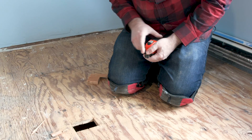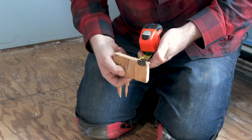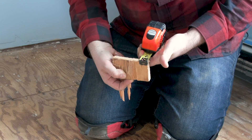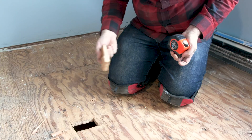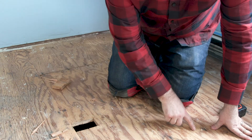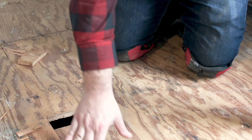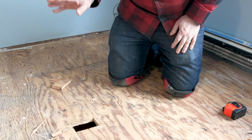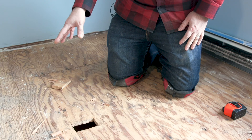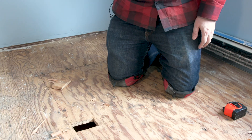Okay, I got the piece of plywood removed and measuring it, it is 3/4 inch plywood, which is what I was hoping it was. So now I'm gonna have to mark out some lines across here and then cut this section out. The oscillating saw is not going to work well for this — it was great for taking off a little tiny piece with fine control — I'm gonna have to use a circular saw.